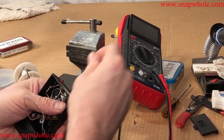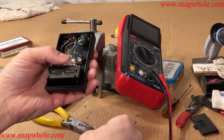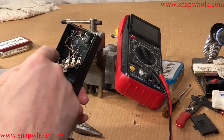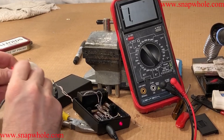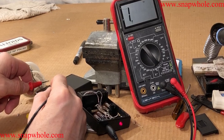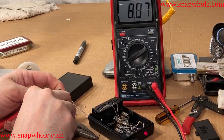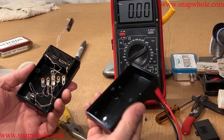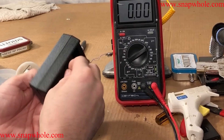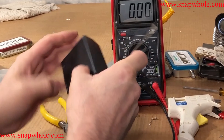That's pretty good — the pigtail slips in and out pretty easy. This is my supply. I want to check it and make sure there are no wires touching that shouldn't be, then check the output to see if it's still working correctly. Reading 8.87 — that's as close to 9 as we're going to get, at least with this measurement and this supply. But it's exactly what I wanted. Now I just need to put it together and put the screws in. Everything needs a label.